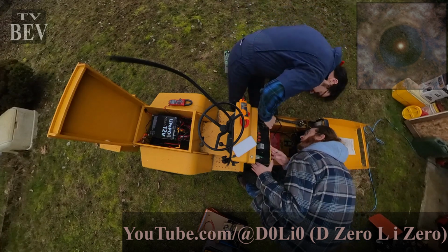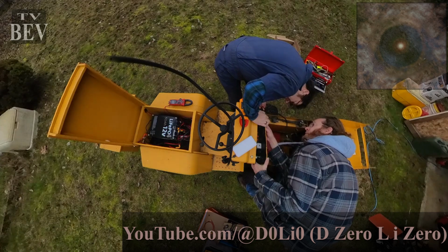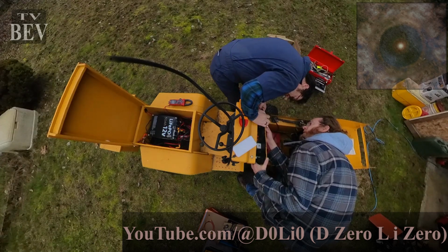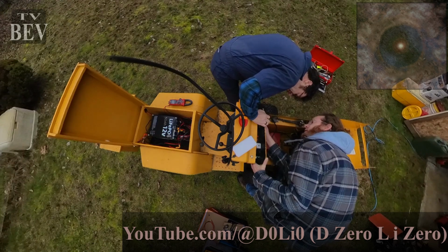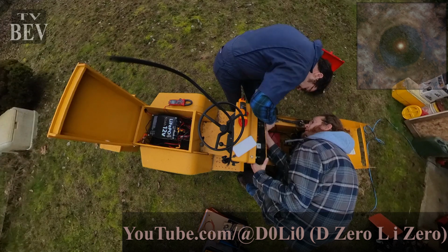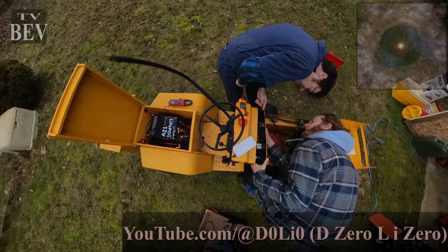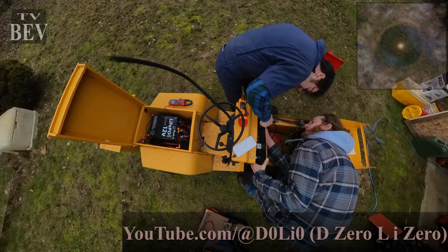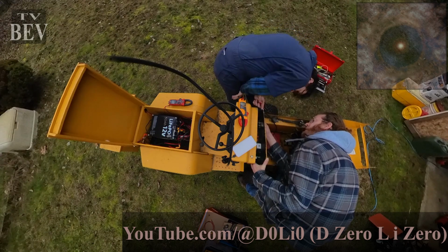Okay. Is there a fuse? Yeah. Fuses are here. 20 amp, that controls one, 20 amp. That's intact. That's not going to anything. The center one, now it's got a bastard splice at the bottom of it. Positive, and this says pack negative. This should be pack negative. It's distributed to here by that jumper. So here.